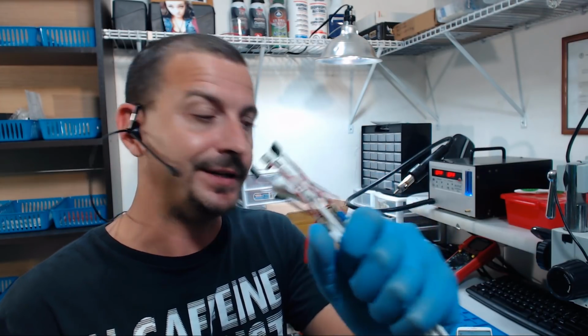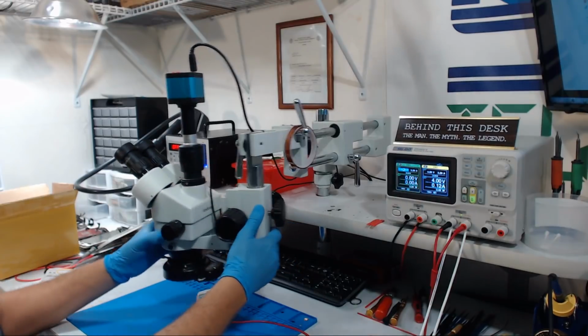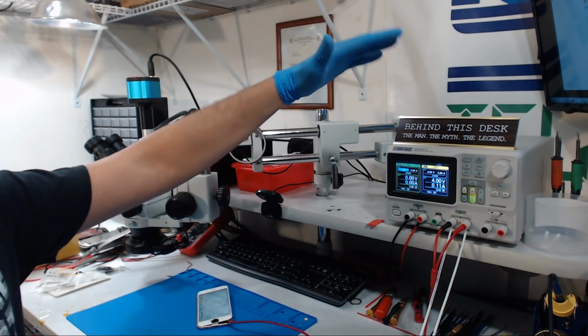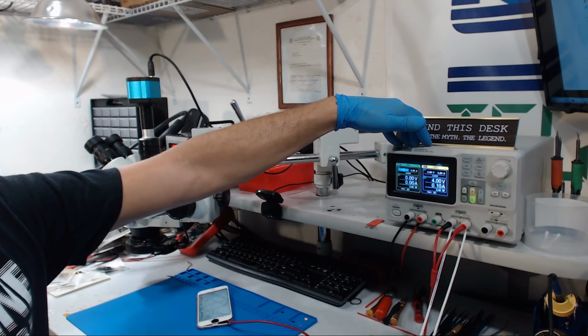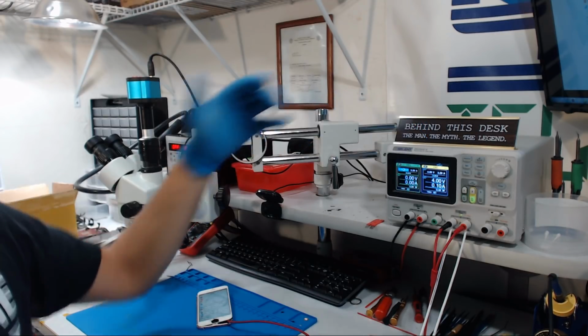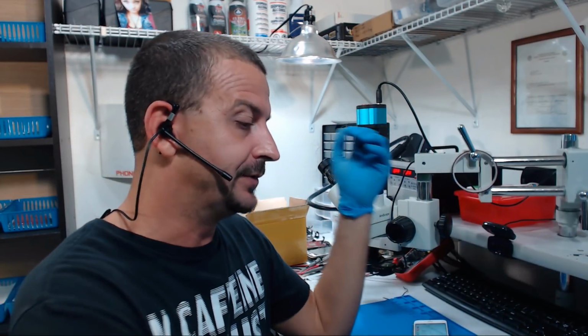They'll come up and they'll run for a little bit, and then they'll shut off and turn back on. They'll just spontaneously loop. So I have not been able to run backups using my DC power supply again. I'm sure it all adds up and makes a difference, but when I first got this Siglent power supply, it was my understanding that my old cheap junk power supply was causing me issues with reboots because of dirty power. It was a switching power supply, and you could hear it switching, and I'm sure it was spitting out dirty power, so that was probably causing some reboots as well.